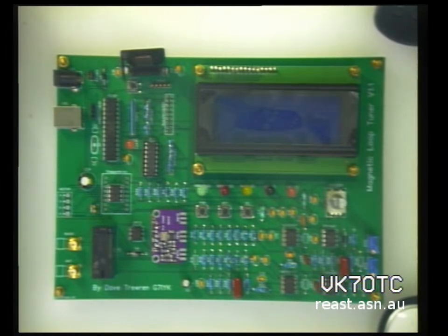I have the magnetic loop right at the moment on 20 meters, whisper, just receive, and it's doing absolutely wonderful work on whisper. I'm impressed. It is really, really sharp in tuning, so that's what this particular board will help me to do, which is actually keep it in tune. When I change frequencies it will retune the magnetic loop to the frequency that I'm on.